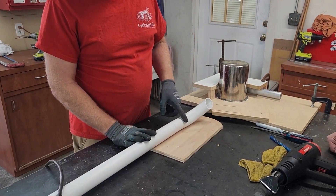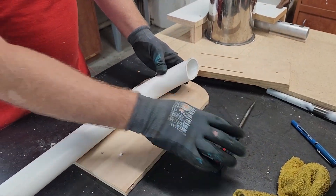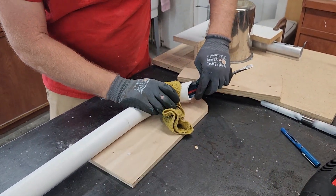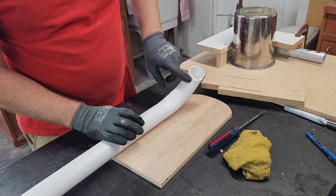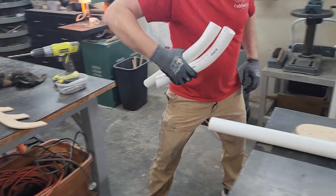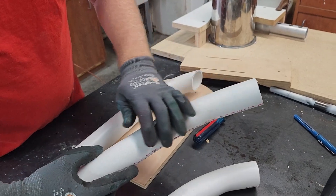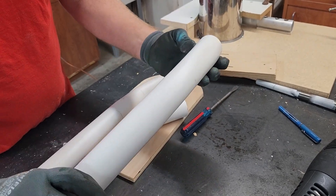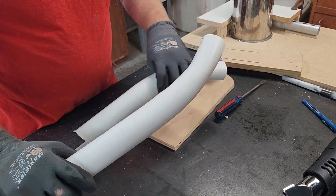We had a little kinks in the pipe. After the bend, once we got the radius where we wanted, we'd heat up the little kink and using the back end of a screwdriver we just massaged it out, then took a damp rag — once we got it where we want, that locks it in so it cools and holds it in place. That got rid of the kinks. There were two pretty decent kinks in the first piece and two pretty big kinks in the others, but we were able to work those out. The part we're going to use is smooth, so it's coming together.